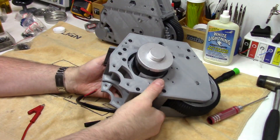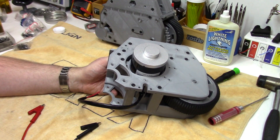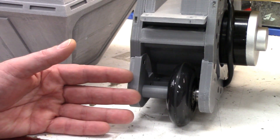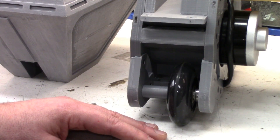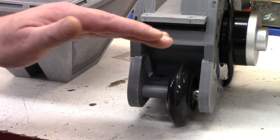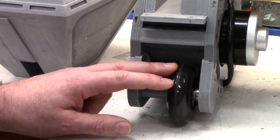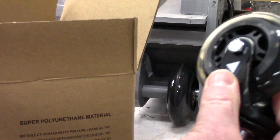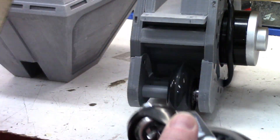I haven't put the rear omni wheel in yet — there are two reasons for that. First, I don't have an omni wheel yet. Second, I don't know if I'm going to be using an omni wheel. I'm using a roller blade wheel instead. The primary reason is I'm just not convinced an omni wheel is suited for harsher driving environments — rough pavement with gravel and sand on it. I have very little experience with omni wheels, so if anyone watching is using omni wheels in their R2 and finds they handle sand and rough pavement fine, please let me know. I think a roller blade wheel is going to stand up a whole lot better. These came out of a set of office chair roller blade casters — if they can hold my fat ass, they're certainly going to be able to hold R2.